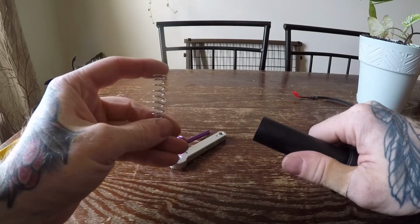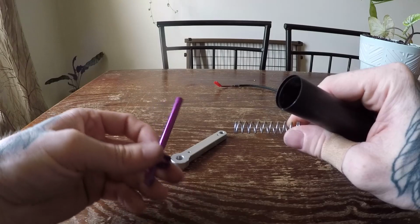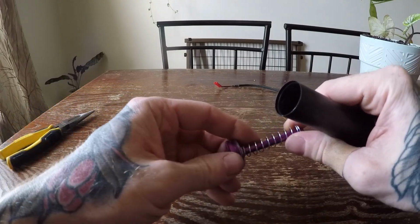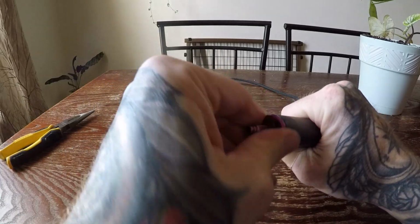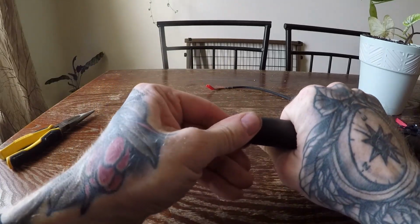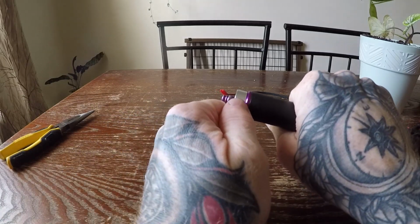The proper spring should be 1.5 to 2 inches long and easy to compress with your fingers. Other than that, it just has to fit over the nozzle and inside of the cylinder. Adding this spring will allow the bolt to return on its own after you rack it for each shot. It keeps tension inside of the cylinder so the nozzle returns forward consistently into the hop-up chamber and bucking.